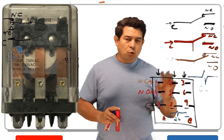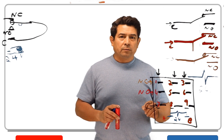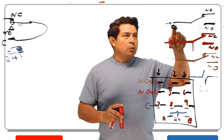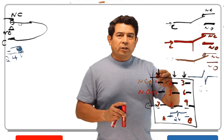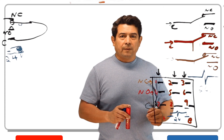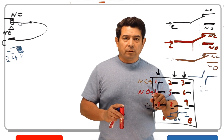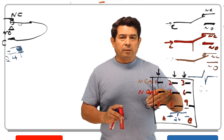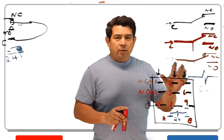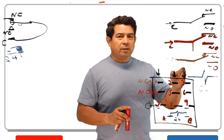One of these days, what might happen is you run into these and let's say that you only have 7 and 1 — you don't have a 4, 5, and 6. So that relay means that it would only be for normally closed — you could only turn something off for this circuit, this circuit, or that circuit. If you had a connection between 7 and 4, it would only be so that you can turn something on. I like these right here because with these I can do anything I want — I can turn something off and turn it on, and I can do it for three different things.